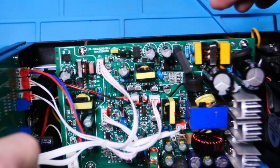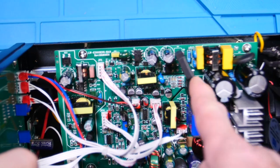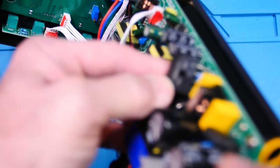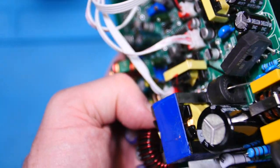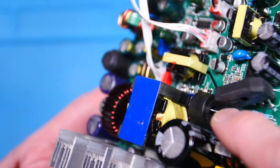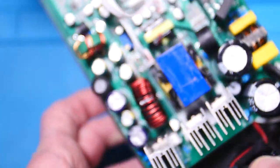And then our EMI filter, our combo choke with our two X capacitors, poly caps, and then our blue ceramic capacitors for a Y, and then a big old bridge rectifier there. Alright, and that's a KBU 810. Look over here. See that guy right there? That's a current sense transformer. So we got our wire going to that. That's a nice touch. Those aren't cheap.